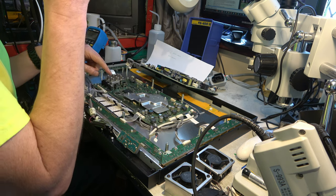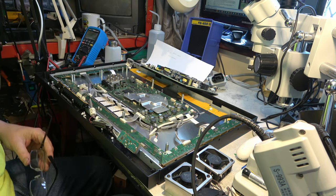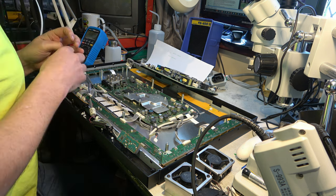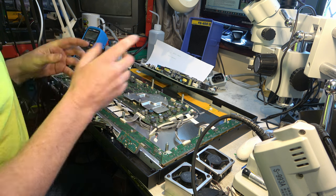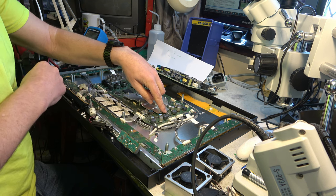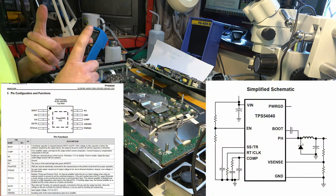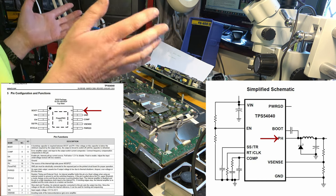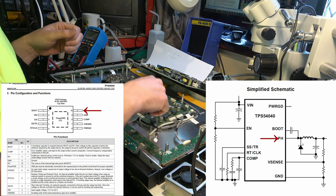One person said we could be looking at BGA soldering issues, and if that's the case it could be virtually impossible to resolve. Somebody else said why don't you get your oscilloscope out and start looking at the signals — without any schematics, that's really going to work. But I will actually get the oscilloscope on the output of this regulator IC, even though we don't know what signal we're looking for, and it's described as an input rather than an output — but it is effectively the output of the IC on pin 10.